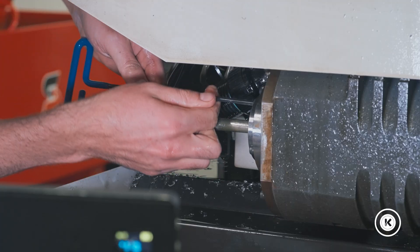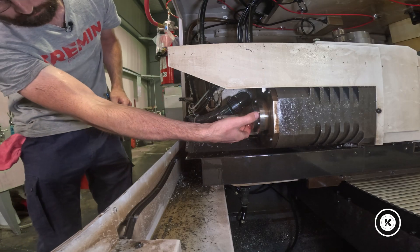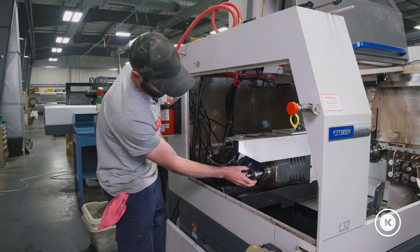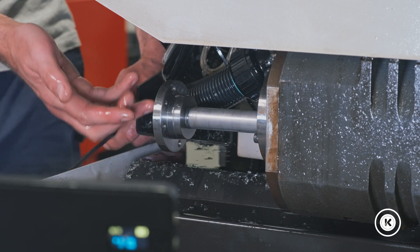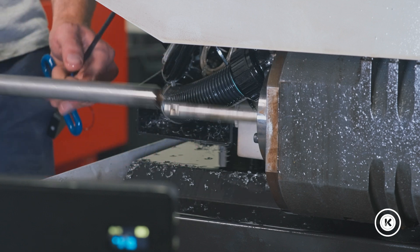Please don't put quarter-20s in. Those are out. This should come right out, and it did. If it doesn't, there are two threaded holes in here — you can run a longer M6x1 screw in there and press this out. There's two of them, one on either side — just work them in there and press this out.